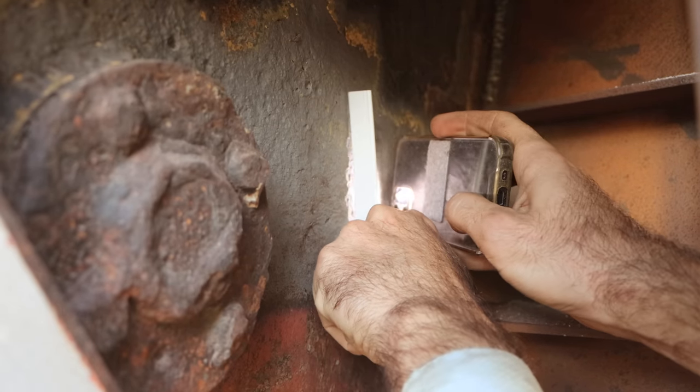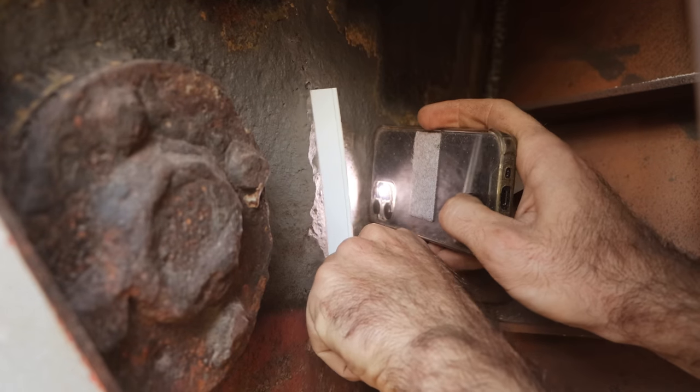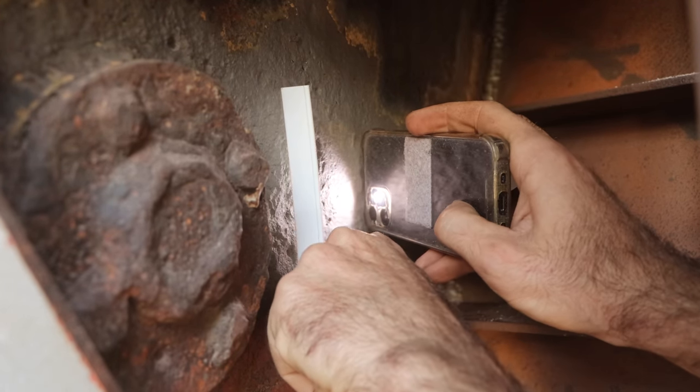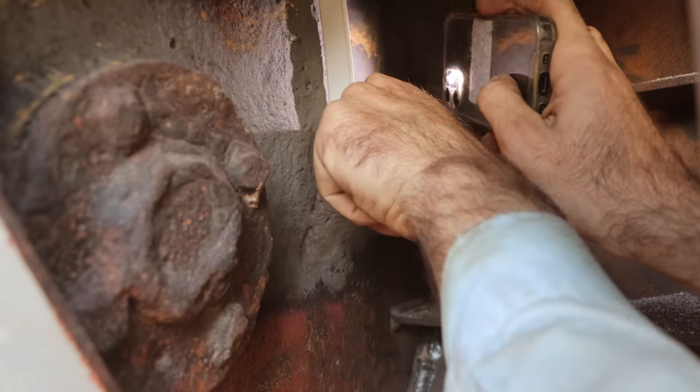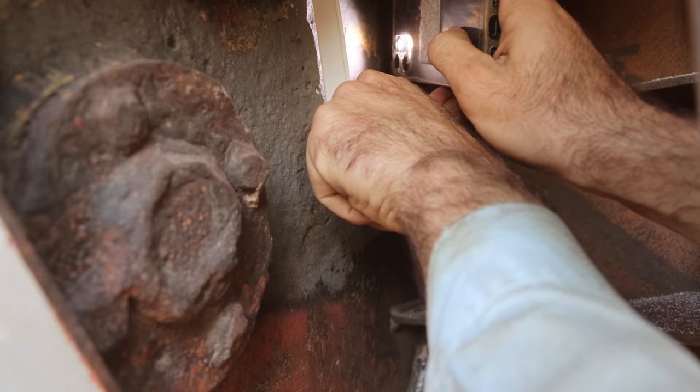And it's pretty much where we suspected it would be, where that waterline is. That's probably the worst bit right there. You can see there's kind of a tall bit, and then sort of works its way along. Also up the top here, there's a few pits that are reasonably deep we need to deal with. Given that we've been able to take all of the rubbish off that pitted area, it's worth getting in there now and pad welding.